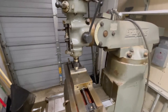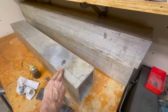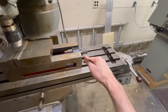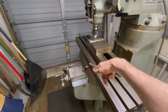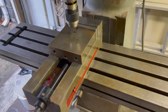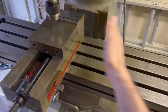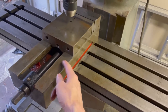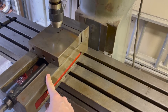If I have any capacity issues I can tilt the ram and pull it out more. If I need to make this surface square to the axis — if you pretend this ruler is the column — I can have the column mounted out here so the square part is up here, tilt the ram out, face the top of it, and use this to keep it square. I'll need some creative fixturing to hold everything on the T-slot. I was thinking of using a matched pair of vises with the stock in between them, but I doubt I can find a duplicate of this vise I bought 20 years ago. I'd probably have to buy two new vises, which would be pretty expensive and I'd probably never use them again.